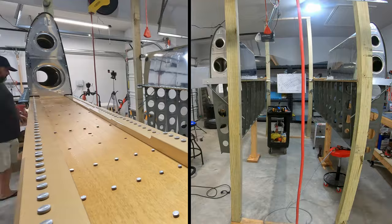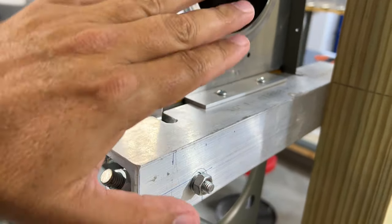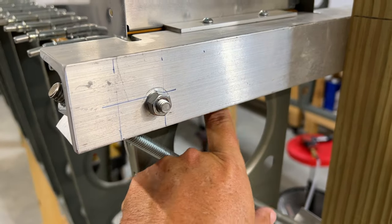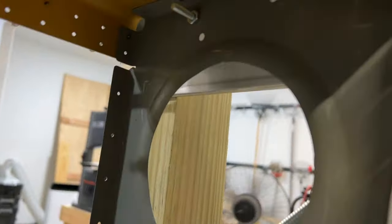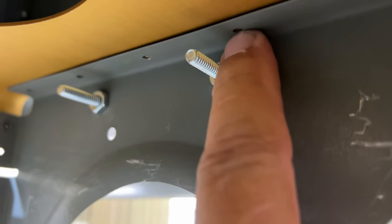Here's what I was talking about earlier. This bracket right here is something that you make so that you can hang the outboard end of the wing on the stand. You do it by drilling a couple of 7/16 holes through the web of this spar up here, you've got a piece of angle, and then you run those through to bolt it on. But if you look, you can see that these bolts are really close to where that rivet needs to be - you can't fit the bucking bar inside there to do that.